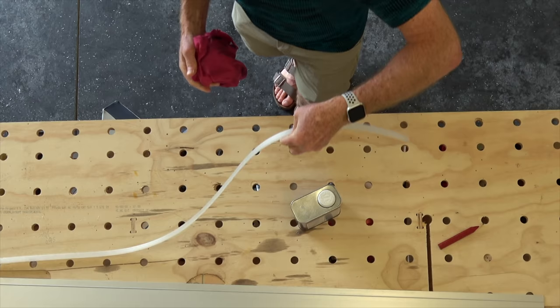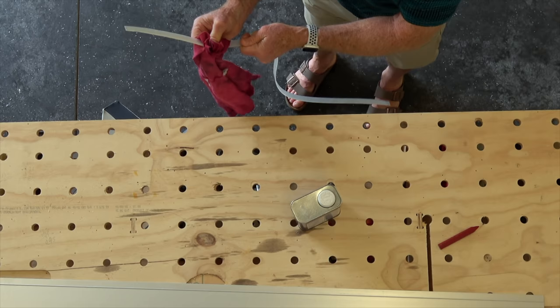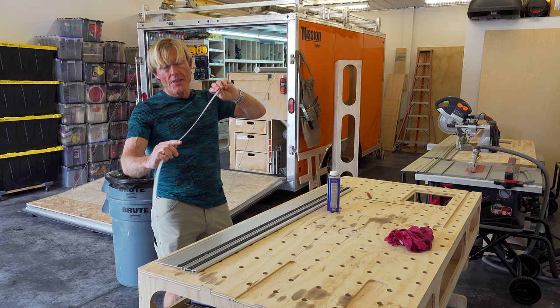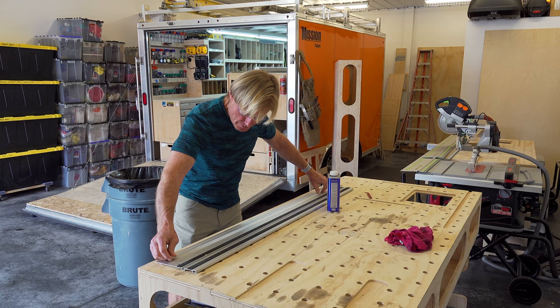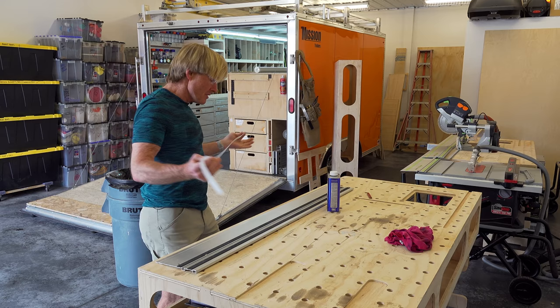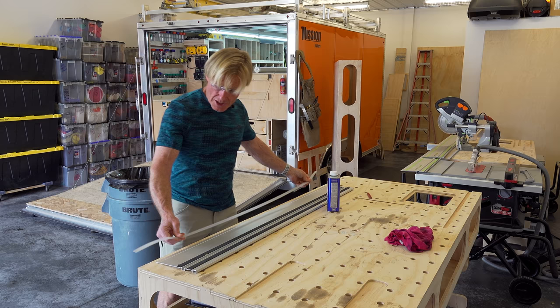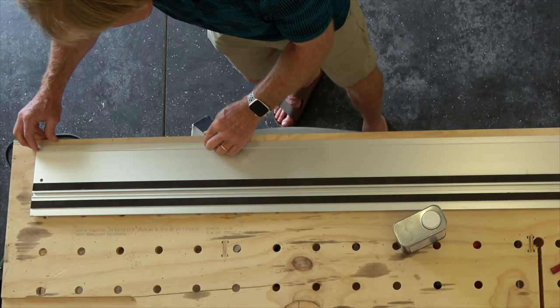Since I'm reusing this, I'm taking the extra step to wipe it clean with the lacquer thinner rag. There does seem to be a thickened edge — like a little lip on this — and I noticed that when I pulled it off, that was to the outside or the cut edge. So I'm going to put it back on the same way. This one is the most damaged and most-used track I have; it gets a little thinner on one end where it must have slipped at some point, so more of it got cut off. There's a shallow rabbet in the track where you put the splinter guard right up next to it so it sticks out far enough, and then you make the final cut with your saw to fit.